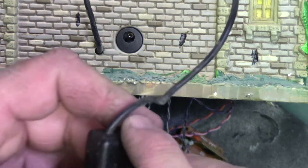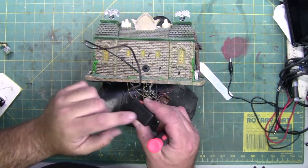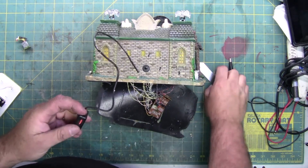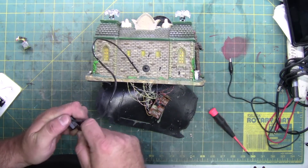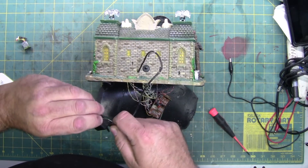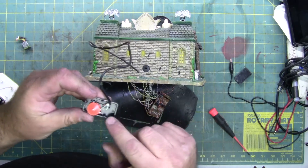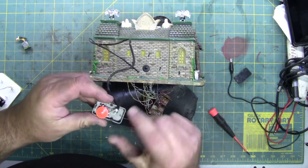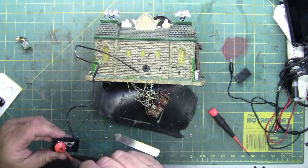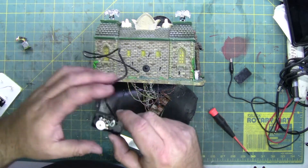Always check this first. If you don't want to tear the bottom of your house off and risk breaking a piece, just pop it open — use your fingernails, or if you can't get in there a small piece of metal, pocket knife, or spudger — and pry this open; they pop together with pins. You can see the pins and the pins go into the respective holes. You also have the wheel that clicks on and off — you have to take this itty-bitty little screw out. If you have to break off the pins and it won't stay shut, a dab of hot glue — do not use gorilla glue or super glue because you'll never open it up to fix it if it ever fails.